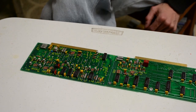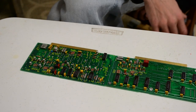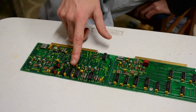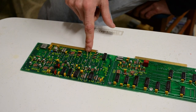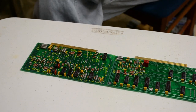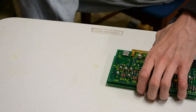Again, it's hard to find documentation on how these work, so it's a lot of inference. If I can power it up, I can start feeding things in and see what happens. So a power supply design is kind of high on my list. And what's odd with this interface card is there's a lot of test points left on it. Test point something, there's a solder blob in the way. Test point 9, test point 10. Again, a manual for the black box would make this pretty simple. Right, moving on to the next card. Put that pair up there.